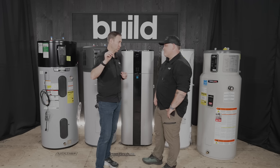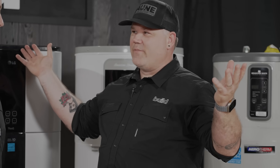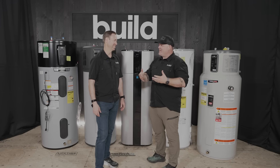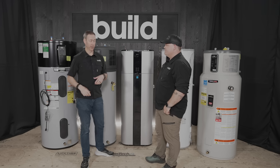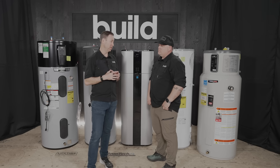When you think of a heat pump water heater, how do you explain it to a customer? Just like your refrigerator is taking the energy inside the box and expelling it out into the air, the water heater takes all that ambient energy and puts it into the water. You've had a heat pump in your house all along whether you knew it or not. It's just taking ambient heat and dumping it into the tank — and it does it very efficiently.